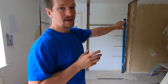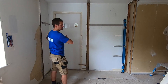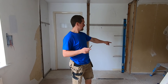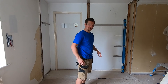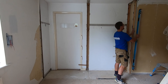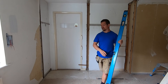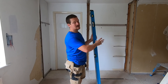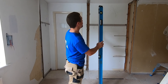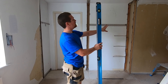So basically what we're doing is this wall here to the right - we're going to follow that through into the existing here. We want to make that one straight wall. There's a few things we want to get out of the way first. What we want to do is map out a line where this wall is going to be. The first thing we will address is that this wall is not plumb - it is quite far out. There's no point me making my wall completely plumb when what I'm matching into isn't. So what we're going to do is mark out from the existing wall and get all our markings from there.